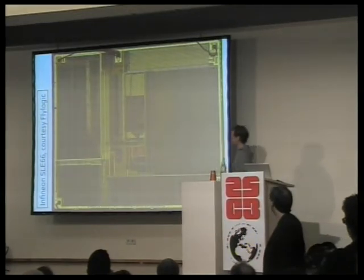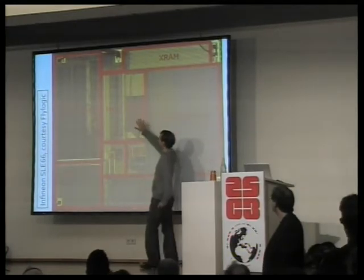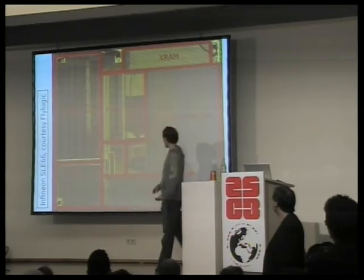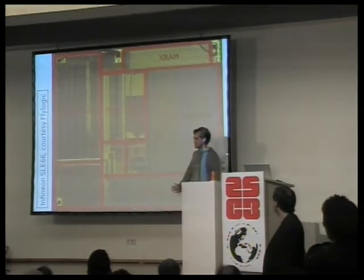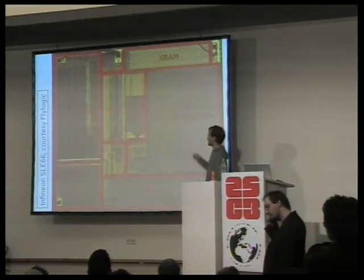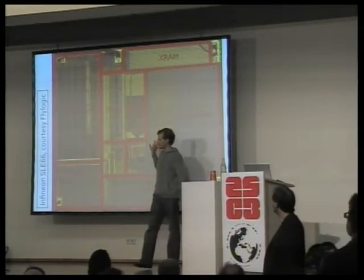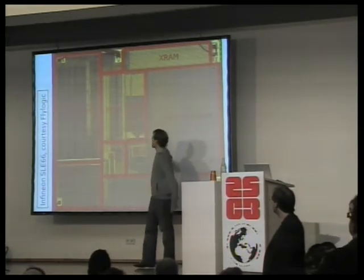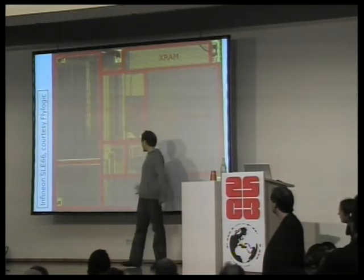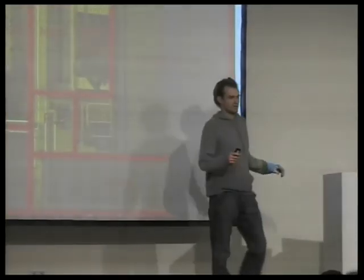Most of this chip area is memory and security. So the actual microchip is only this middle part. And it's a somewhat secure microchip because everything that is stored in these memories is encrypted. If you were to just read out the memories, you don't learn anything. But in order for the processor to work on the data that is stored in the memory, it has to be decrypted. So there's a memory encryptor decryptor unit, and everything that's read in the memories first goes through here and is then processed in the processing core.